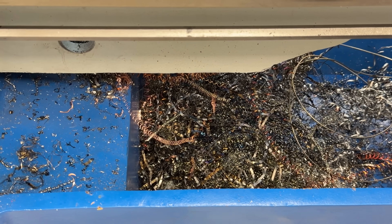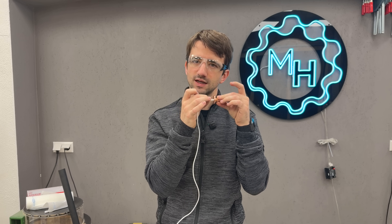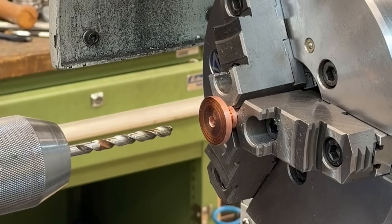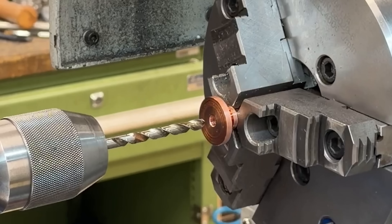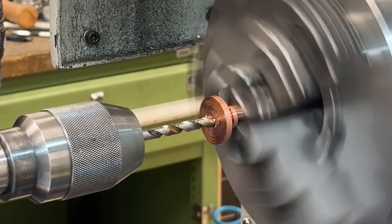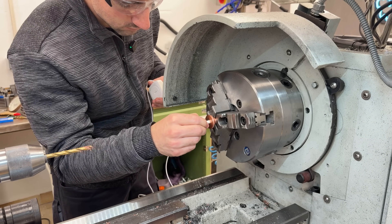Still a bit hot — ouch! Now while this fits, the plastic sleeve part of the sensor is a little bit bigger in diameter — six and a half. So I'm going to re-chuck the part and drill the hole here a bit larger so it fits snug and stays in place. Looks like the hole wandered a bit. Nothing to lose — let's try it. Yeah, that should work. Drill didn't snap, the hole is bigger. Great — that's snug.